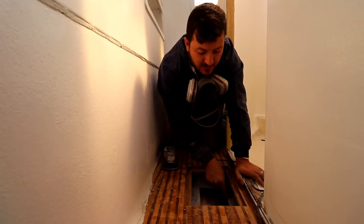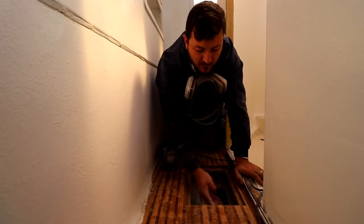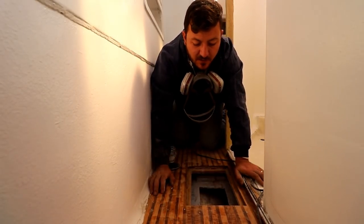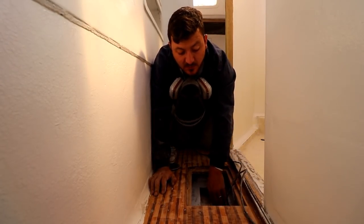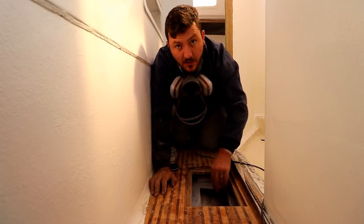What I'm going to do is cut out a piece of fiberglass that's the same size as this to cover it, and then I'll do a couple of laminations completely over the entire surface area. The reason why I'm going to put the piece of fiberglass in is so that resin doesn't seep in and also just to thicken up the area.